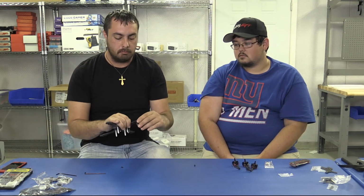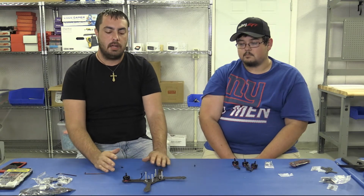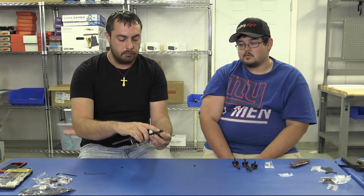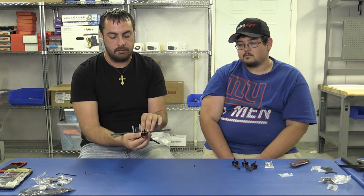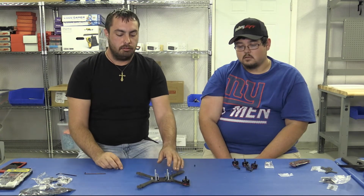All right guys, so these motors, we will just want them roughly finger tight. No sense in tightening anything like this down right now because something may have to move later on, and there's no reason at all whatsoever to tighten this stuff down. You've seen how I've done this motor. You got your 4 screws here. You want your wires running toward the inside of the frame, just like this. Now repeat this with the other 3 motors, and we'll check back with you.